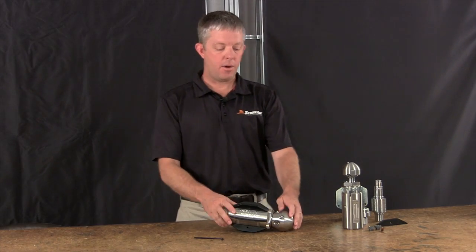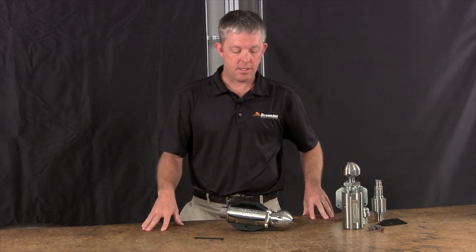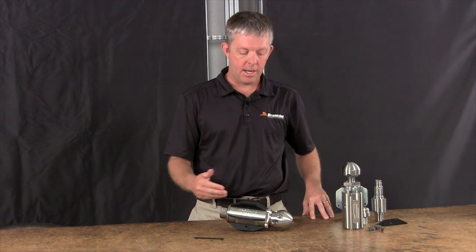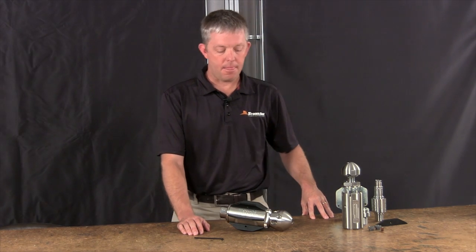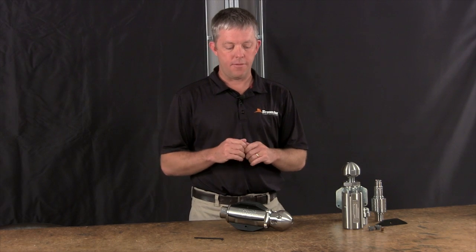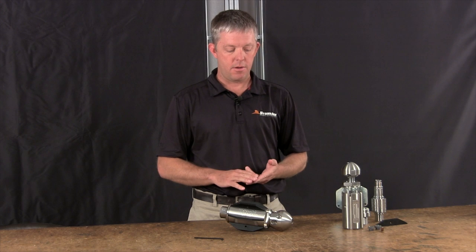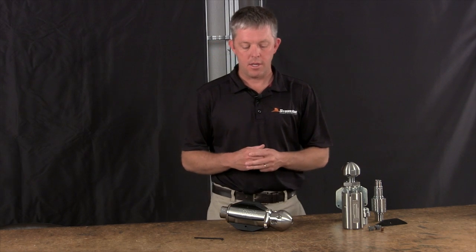Some final notes on the WGR and the competitive landscape for rotary sewer nozzles: there are more than a handful of quality, long-lasting tools out there, but based on all the performance enhancements described in this video, we have a really strong competitive option. What you need to focus on when talking to customers is the cost of ownership over the life of the tool — not the initial price or just a kit price, but the price per hour of owning that tool. We've extended fin life, reduced the number of head options needed, and extended the life of the viscous fluid. We're talking about parts costs, but also the downtime cost of taking the tool off the truck, going to the shop, getting it repaired. Focus on those aspects when comparing against competitor tools.